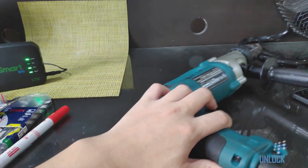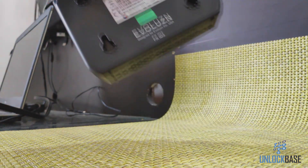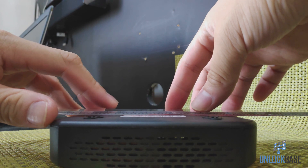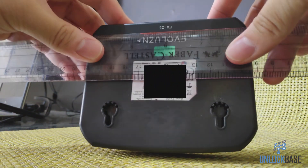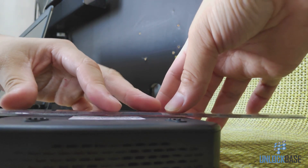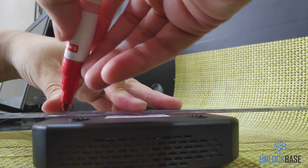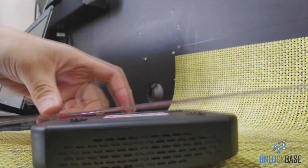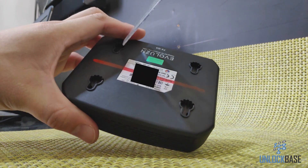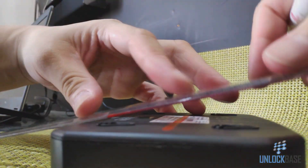You'll also need a working drill and a ruler. Before we do anything else, we're gonna use the ruler to draw a line as a guide for where to drill later. Go ahead and line up your ruler somewhere over here, and then draw a line with the marker. We're gonna be drawing two more lines here and here — if possible, match them with the holes just to keep things consistent.